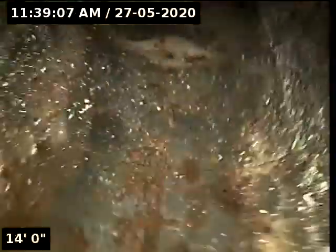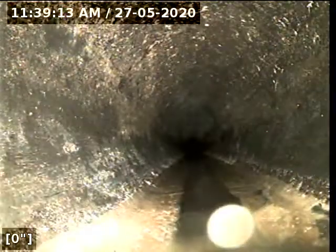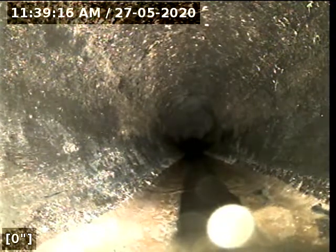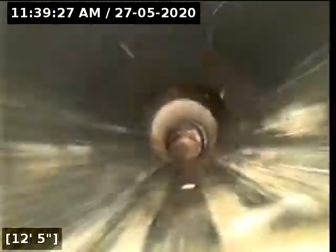I'm going to find running water — I have water running from the kitchen sink. I have the foot counter zeroed, and I'm just going to keep going. I'm assuming it's going to empty out in the south street. We just now transitioned from ABS to PVC, and now to 3034. A little bit of sludge on the sidewalls there.